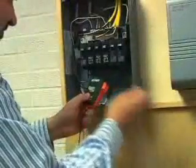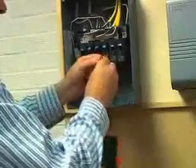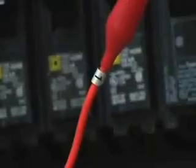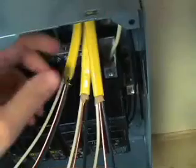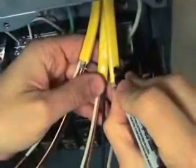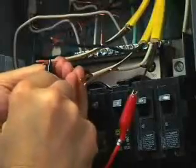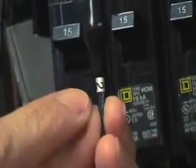The polarity feature can be used to identify multiple cables. We will use three Romex cables to demonstrate this feature. We will connect the red test lead to the ground wire in the first cable — notice that the red lead has a wire marker labeled number 1, so we will label this cable number 1. Now we will connect the black lead to the ground wire in the second cable — the black lead is labeled number 2, so we will mark this cable number 2.